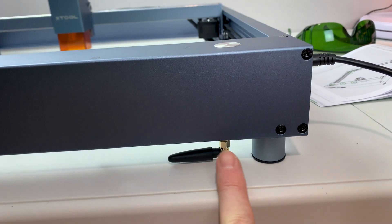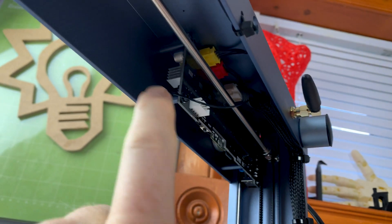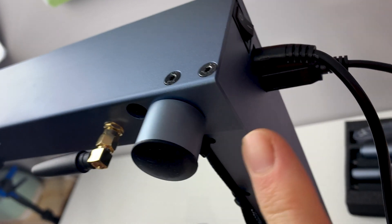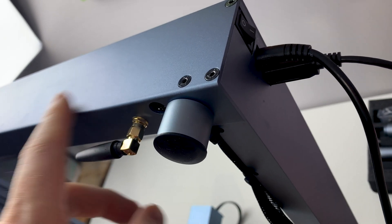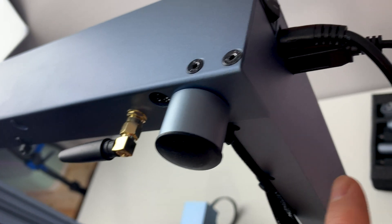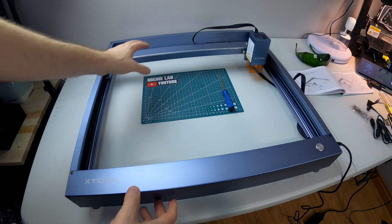One more thing I don't think is acceptable: the Wi-Fi antenna comes out of the controller through a long coax to the PCB, but this could easily be routed out the side. It would have a little bit of RF attenuation from the frame, but it would be completely protected from getting hit on the bottom like it is now. It would be a far better location and would still clear the belts.